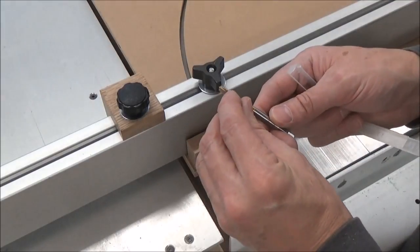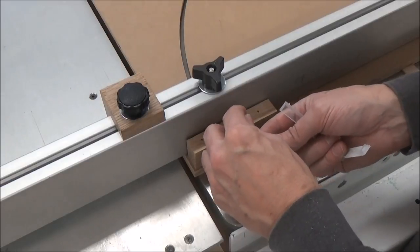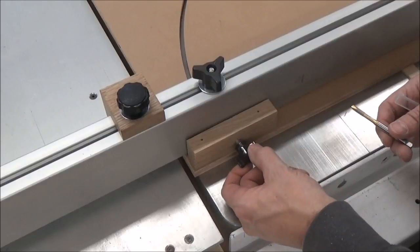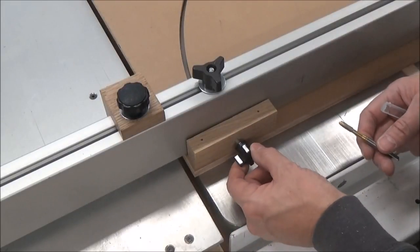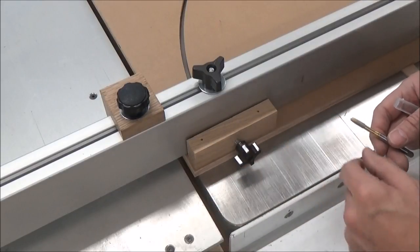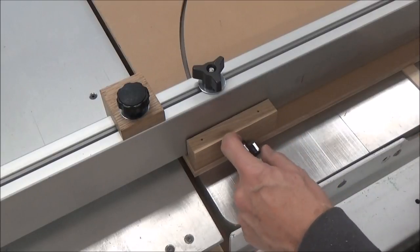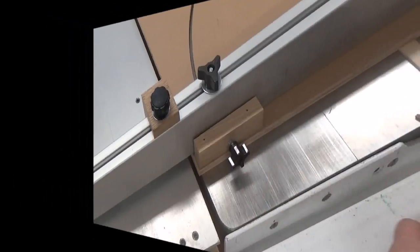So as your tap is coming through the wood, and you start to see this just probably about that much in my case, I stopped short basically and then backed it out, and then I let my threaded rod here finish threading it, and it gives you a nice tight fit. It's not going to loosen up on you while your saw is vibrating or whatever. This thing is going to stay in the position that I put it in because it's just got that nice tight fit there in that last eighth of an inch, I suppose. So you just have to work a little harder with your knob, but once you thread that with the threaded rod you're using, or whatever you're using, that gives you that extra grip.